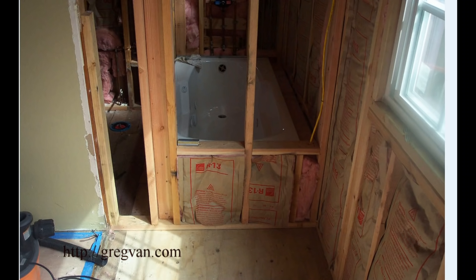Let's take a look at what it would look like after it's done. Here we have the wall framing studs we installed. You can actually make the bathroom the exact size you want. A lot of framers add a quarter of an inch — instead of a five-foot-wide bathroom, they'll make it five foot and a quarter or five foot and three-eighths to give the plumber some extra room to install the tub. But sometimes that involves furring out the walls on one or both sides, which isn't always the best way. Leaving these wall studs out is a fantastic idea and worked great for me.